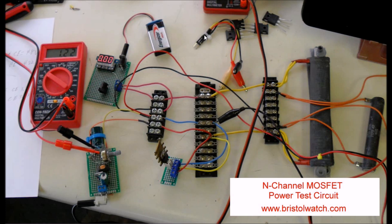Up here in this corner, you'll see this also plugs into that particular socket, and I use that for these larger MOSFETs and IGBTs that don't fit the socket - that's what the alligator clips are about. This meter reads current. This is the voltage in on the gate. Up here it measures the voltage across drain and source of the test MOSFET when it's turned on.